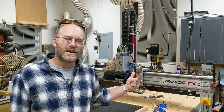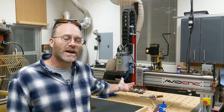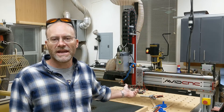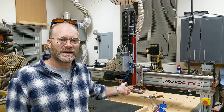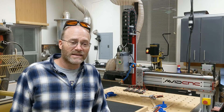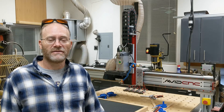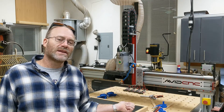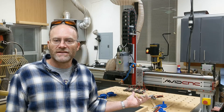Number one is the place or area that's being cut or etched — obviously you wouldn't want to stick your hands in there. This laser I have is 15 watts; it can cut eighth-inch plywood at about 15 inches per minute. So it wouldn't take a finger off as fast as a table saw would, but it would sure hurt — it would cut very deep and be painful.